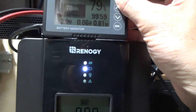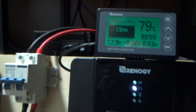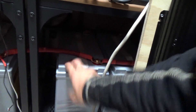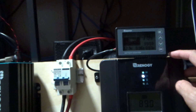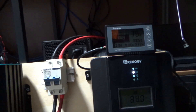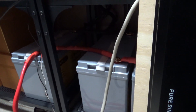The small meter here kind of confuses me. I switched it to 100 amp-hours because it seems more accurate. I have five batteries and each battery is 100 amp-hours, which totals 500 amp-hours. In the settings I had put it to 500 amp-hours, but for some reason it seems more accurate when I set it to 100 amp-hours. Something seems wrong there.